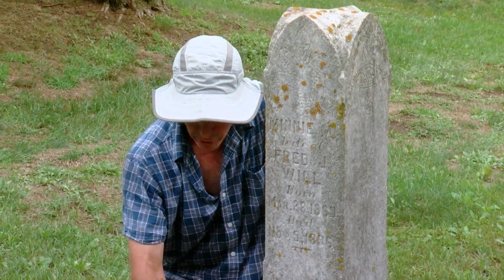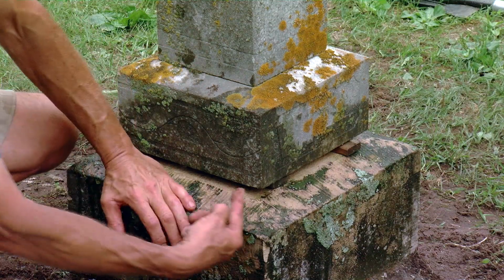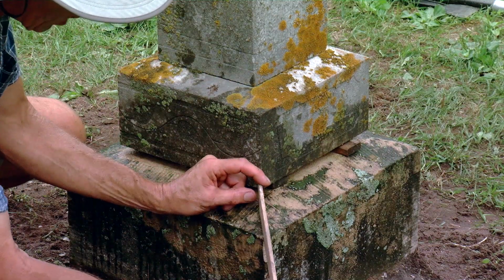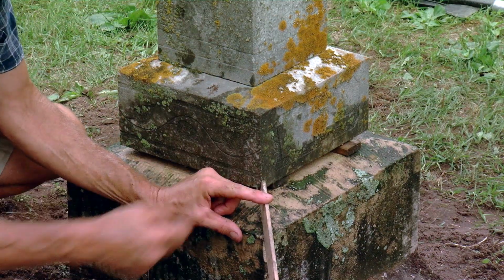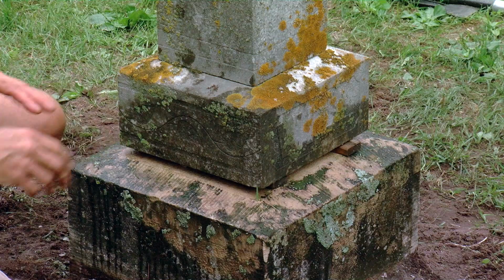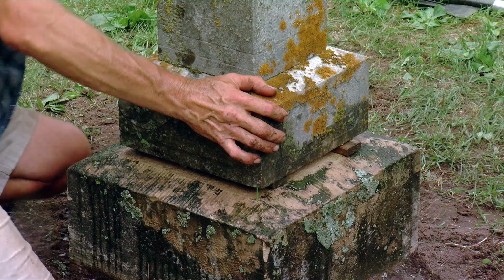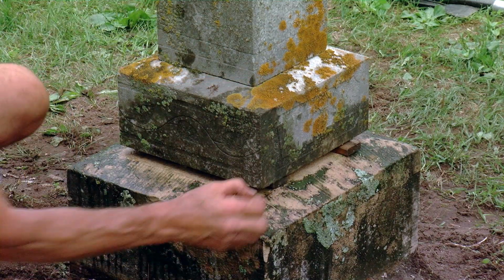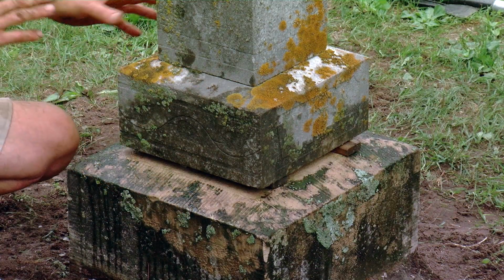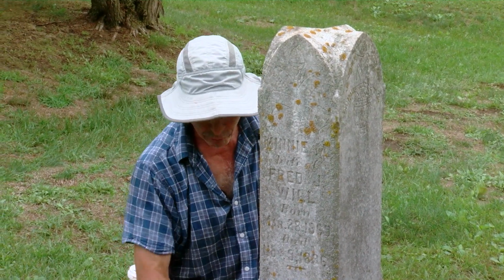This is called a wash. This angle right here is called a wash or a drop wash. And when the 2 drop washes meet, they make a bevel right here. This angle right here, you can define it with a small tool like a block. Just like that, it should come into the corner there. And so we're trying to have that on each side. But it's really close. Once we do the final joining, we can fine tune it from here, but it's very close right now as it sits, just by eye visually. If this didn't have a drop wash at this juncture, it would be good to measure because it's hard to assess the spacing. But with the wash, that establishes exactly where it should sit because we have this reference.